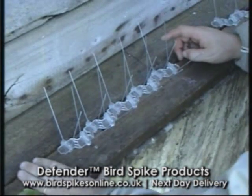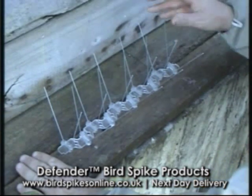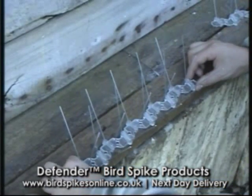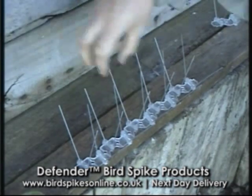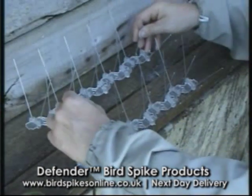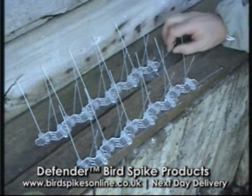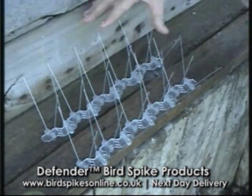However, if this was an overnight roosting site or a nesting site, pigeons would be very, very determined to get onto this ledge. So in that situation, what I would do is pull the base to the front leading edge. You'll then notice there's plenty of room for me to get a fist in behind. A pigeon could scrabble into that gap behind. What I would then do is insert a 2nd row of spikes in behind just for peace of mind. So when it's an 8-inch ledge, it's a bit of a dilemma, but if it is an overnight roosting site, for peace of mind, I would put on 2 rows of spikes. Obviously now there's nowhere for the pigeon to go.